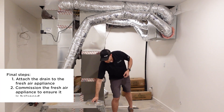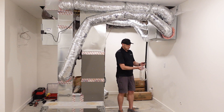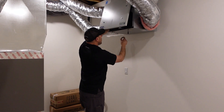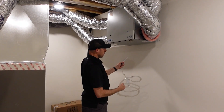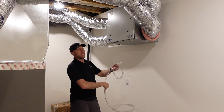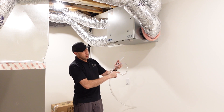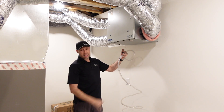We have a few remaining steps. Our first is the optional drainage — Fantech offers the kit, which is actually included, with tubing that allows us to drain directly to our floor drain. The important thing to note is that we really need to ensure the trap — basically a loop in the tubing that allows some water to remain in the tube. Otherwise, when we're running this fan, it could depressurize and draw sewer gas through the tubing into the system, and obviously you don't want that in a fresh air appliance. That simple loop will hold some water from dehumidification, blocking sewer gas from coming in.